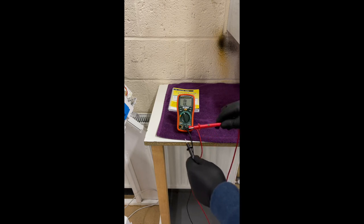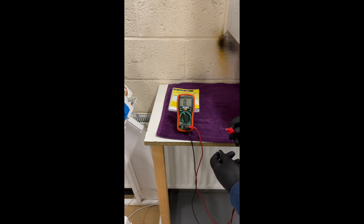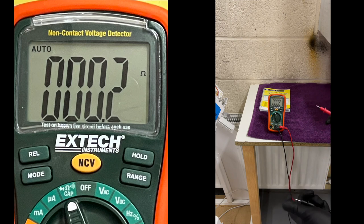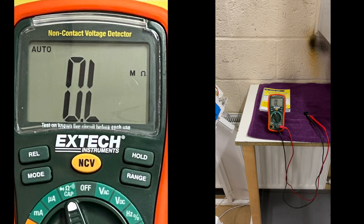The next stage: I'm going to make an X here on these probes, and within two seconds that OL has to go to zeros — full stop — and then a number, and that number has to change within 10 seconds. We do know that some Flukes don't do this and some do; we don't understand why because I've asked the rep and he doesn't know either. Some models do, some models don't — all of these have to. So let's do the first test: we make an X, press hard, and there we are — two seconds and it's refreshing. Let go, two seconds, it's got back to OL. That's a perfect multimeter ready for use.